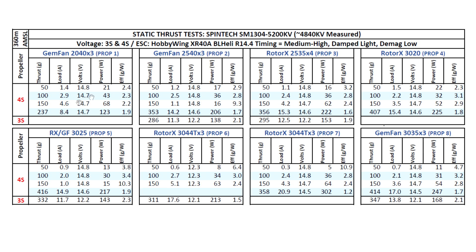You can take a look at some of the 1106s I've tested — some 6000kV motors on 3S and 4S — and a couple of 1108s. I believe I have the iFlight Tachyon 1108 at around 4500kV, which is doing better performance than this one. But this motor is doing better than the 1106s, so it should be a good option if you don't want to use an 1106 motor. That's the thrust test results and review for this motor. Hope you find the data useful, and thank you for watching.